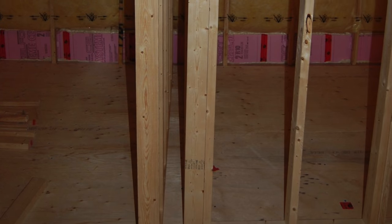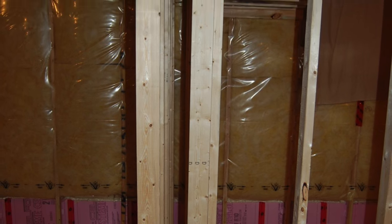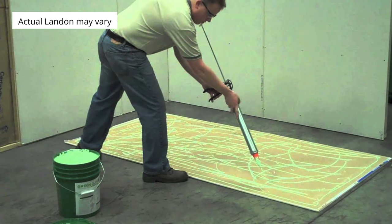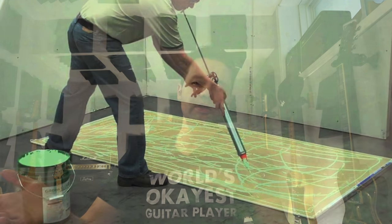Basically, picture a room with another room around it and an air gap — a six-inch air gap. So it's a room inside a room. The walls are constructed with normal sheet rock, or gyp rock, or drywall — whatever you want to call it — two layers of drywall. In between the drywall is this liquid called green glue that's supposed to take sound waves and turn them into heat. Is that true? Is it a myth? I can't really prove that it is or not — I don't have the scientific mechanisms to determine that.